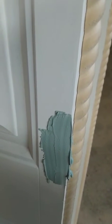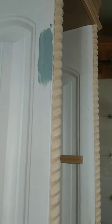So we're going to start by showing you a little trick. If you remember, we had some holes in the side of the door that were left over from the brackets. And if you look carefully, that's auto body filler. We use that to fill up holes, especially when we're covering something with paint and doing it in a color. The bonus with auto body filler is that it has a chemical hardener so it dries really quickly, takes paint really well and does a really nice job. So that's one of your little secrets from a wood shop that you can use at home.